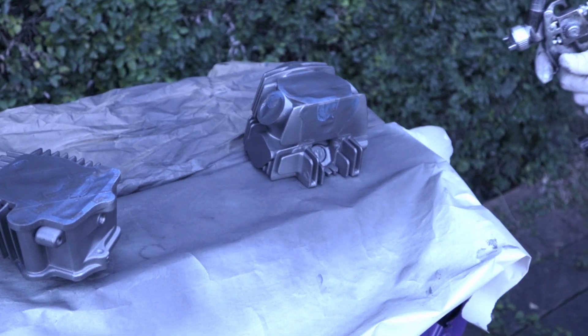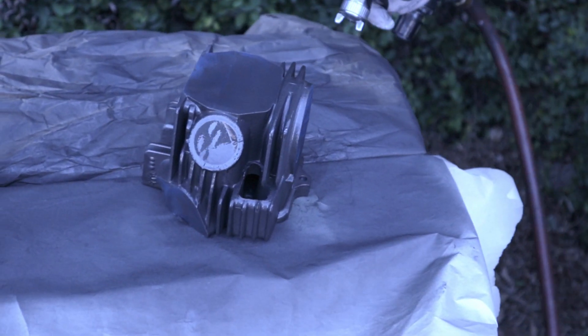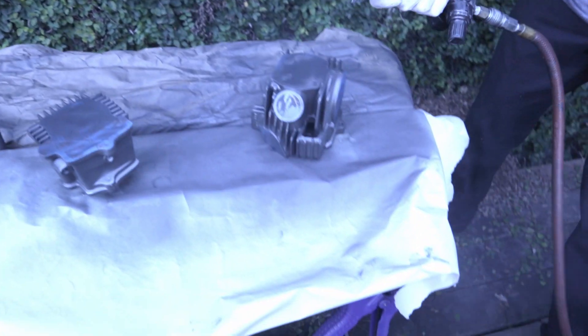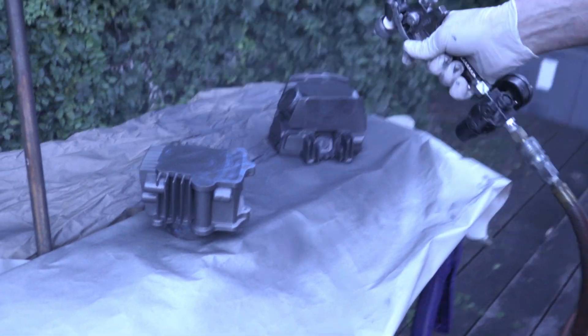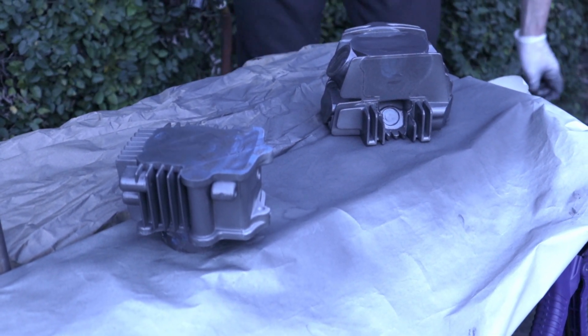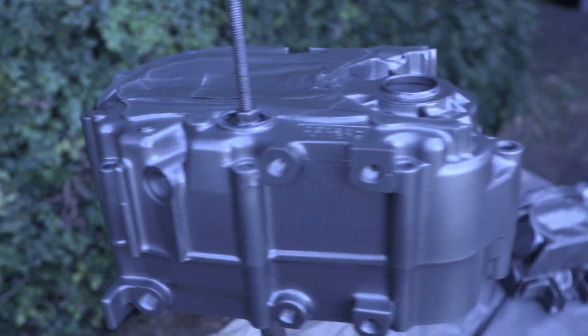I'm going to let that one rest, then go over to the head and put the second coat on. Same technique — different angles from the top, from the side, and then finally when it's all basically coated as best I can get it inside those little fins, I'll lay in a nice broad stroke. By doing it this way you'll avoid runs. That's the biggest trick when you're trying to do detail work like this — you'll end up over-spraying and putting too much material down and having a run. Short bursts at first, then go over the broad spaces last. Just don't get too aggressive and be careful — and it'll turn out looking like this case does right there. It's awesome.